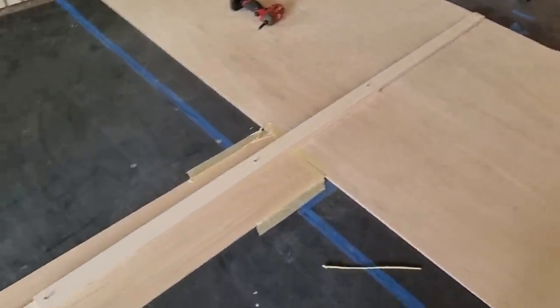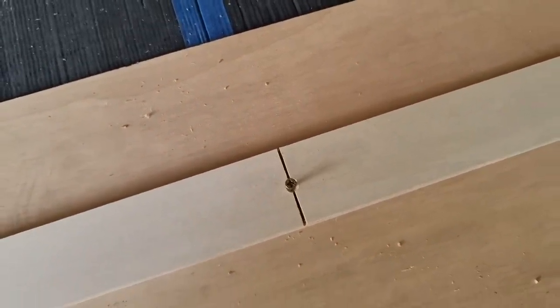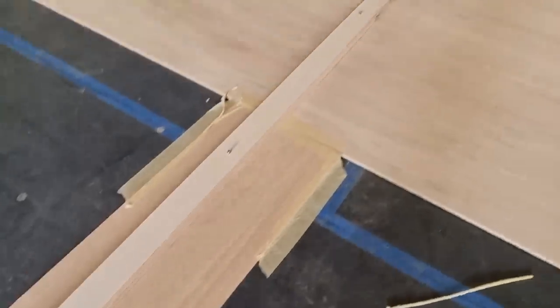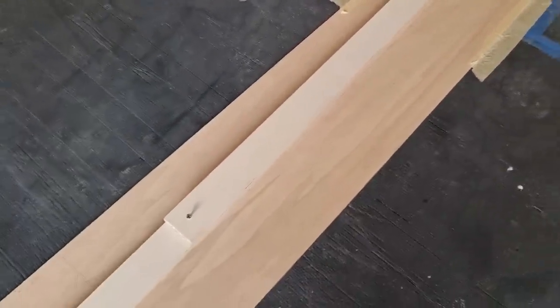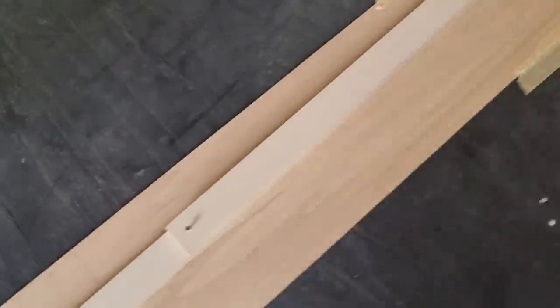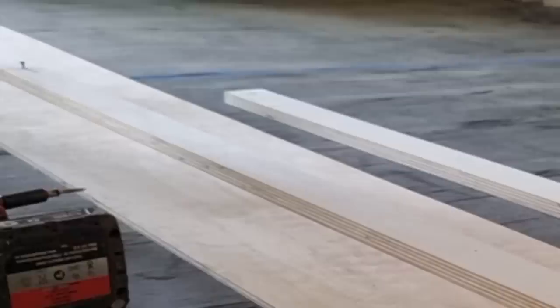On the trammel I've got my pivot point and I put a saw cut there first - that does two things: when I screwed my screw in it centred it, and I also use the saw cut to hook my tape in to set out my radii when working on my own. The first radius was two metres 475 to the outside, which is why this piece of trammel is doubled up. Now I can take the longer length off - I've put a reference mark there - and the next radius I've got is 1555.